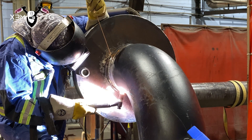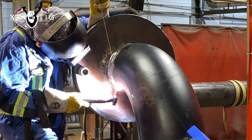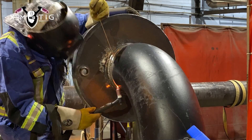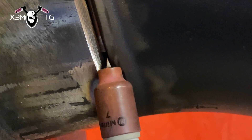I'm leaning on a tack on the side — that's what keeps my rod steady. In most cases you want to hold the wire a little bit lower so you get steady feeding and a steady arm. That's the root pass. As long as the root looks nice, solid, with lots of meat inside — it's a little wobbly because I was holding the wire a bit higher and leaning on the tack to support it so it doesn't wiggle too much, but it's still going to be a little shaky.